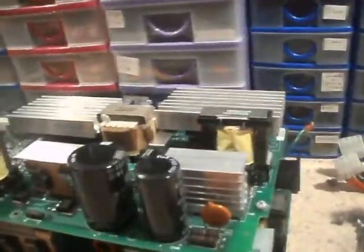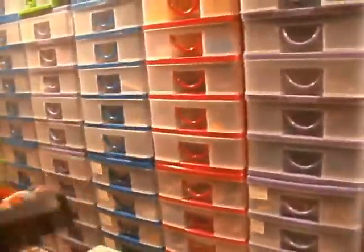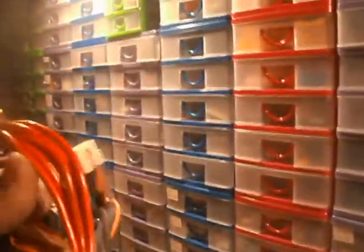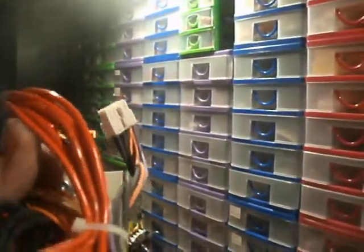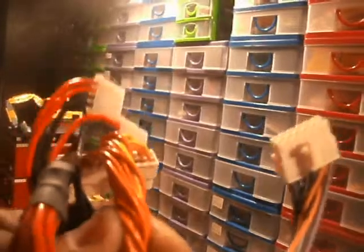These ones I think I'll keep, so if I want a random big power supply for something I've got boards to put in however way I wish. Really what I need to do is plug this in and probe all of those to see what voltage comes out of what. I'm going to guess the red ones are actually the thickest — that's probably the highest voltage, because they are thicker than the rest. But I'm still not sure why there's just a random bundle there and there that seem to join together on this heatsink. They must take some sort of fairly high current because they are fairly beefy wires.